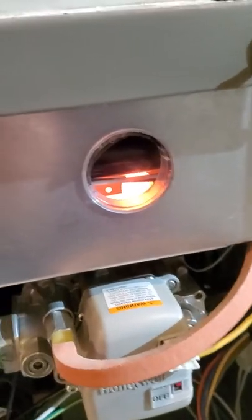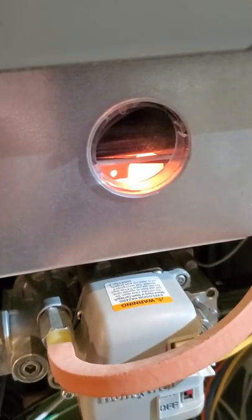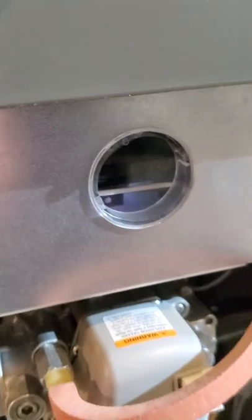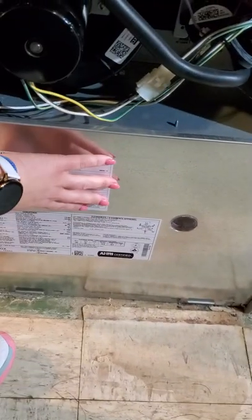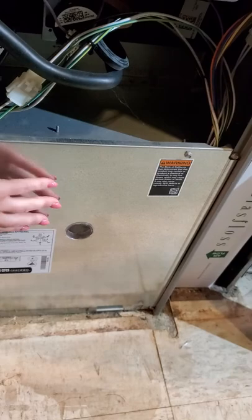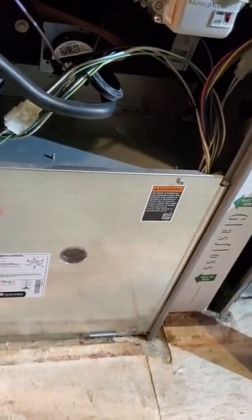This is an enclosed chamber so it's a little hard to see, but once it lights you should have a nice blue flame. If your furnace has an open chamber where you can see inside, you should have a largely blue flame — little flickers of orange are fine, but largely blue means you're getting a clean flame. Then the last part of the startup process: once the plenum gets warm enough, the big blower fan on the bottom kicks on, pulls return air through the filter, and pushes it up through the heat exchanger so you get hot air blowing through your house.